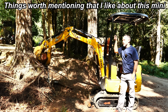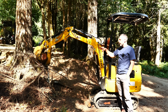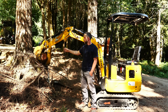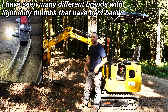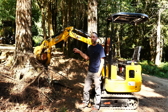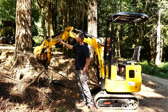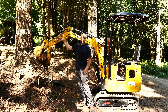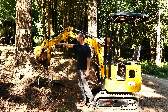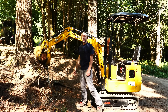I really like the hydraulic thumb. Some Chinese machines have manual thumbs or require hydraulic kits — this one is all plumbed and ready to go. It's been sturdy; other brands have thumbs that bend, and you see that on Facebook forums. I've used this for 30 hours picking up rocks, logs, sticks, and branches with no bending at all. It also has splitter valves so you can retract the thumb, turn it off, and run another attachment like a hydraulic tilting bucket or an auger just by hooking up and rotating the valve.